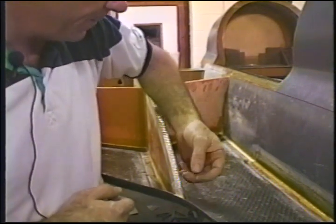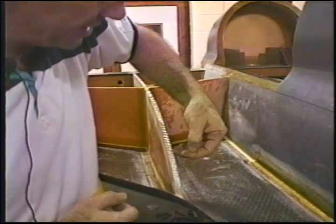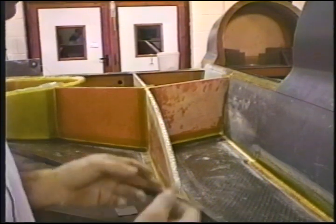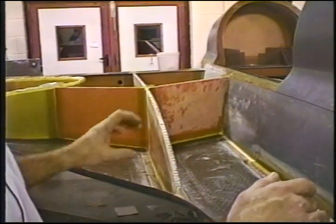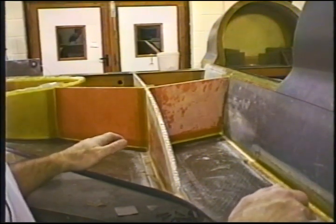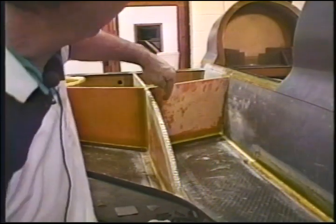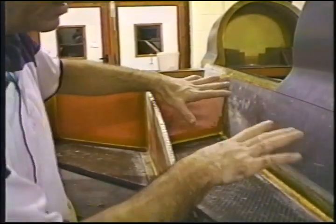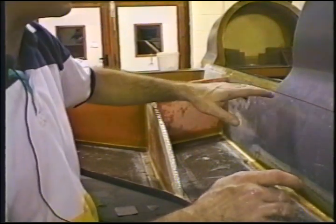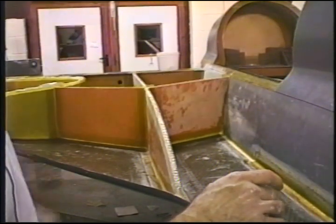of flox between this vertical surface and the T on the top, and put one ply of bid from here underneath. And you can lay that up on foil, do them all, giving you a complete load transition from all surfaces to the underside of your strake. And then later, you'll sand the entire underside of your strake from here and here outboard. You will not sand the underside here, but you will sand it where the side of your strake meets your fuselage. That you'll prepare with a tape for taping onto the side.